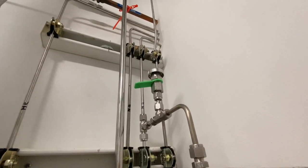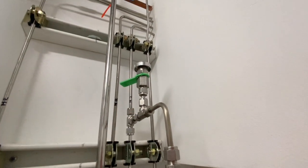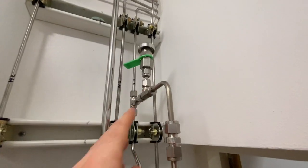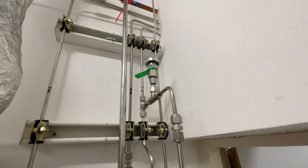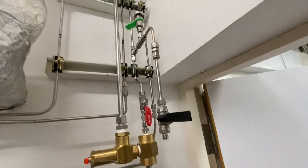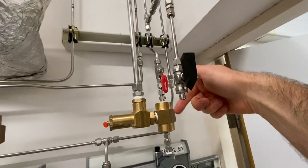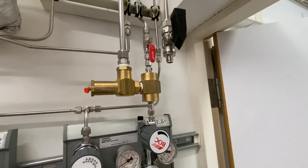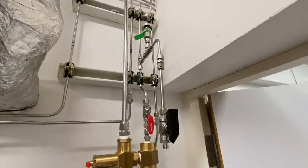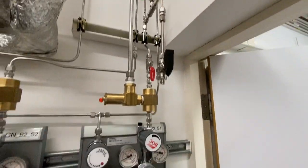There's a valve in here that automatically opens when the pressure inside this line essentially equals the pressure that's in the room. So you really can't build up any pressure inside the gas line. And then finally here we have this valve that goes nowhere, and this is like a double safety. I can just open that now, and I know any gas that flows here has this safe, easy way to flow out into the lab. With this valve open, I can't possibly overpressurize the system, even if this safety valve were not working.